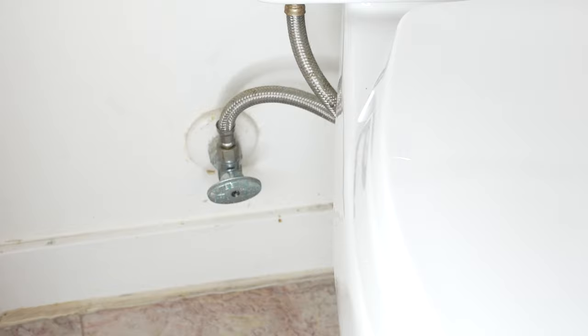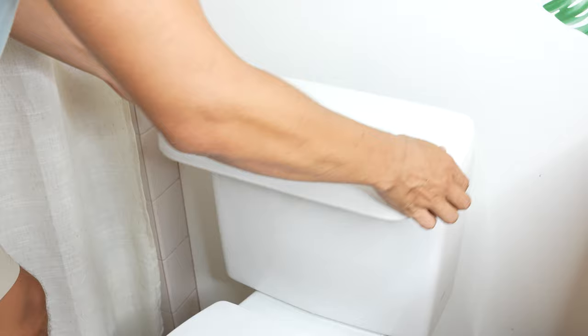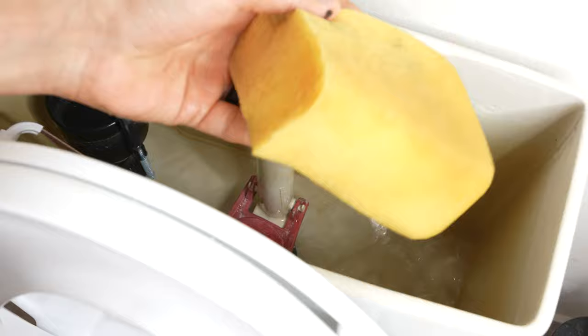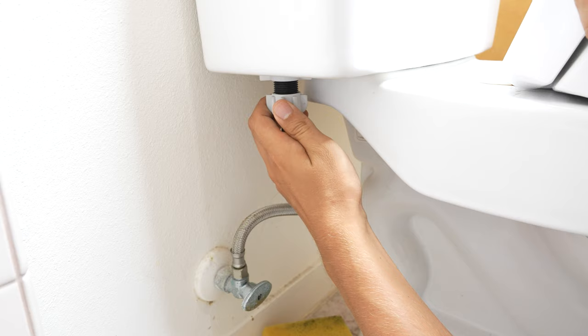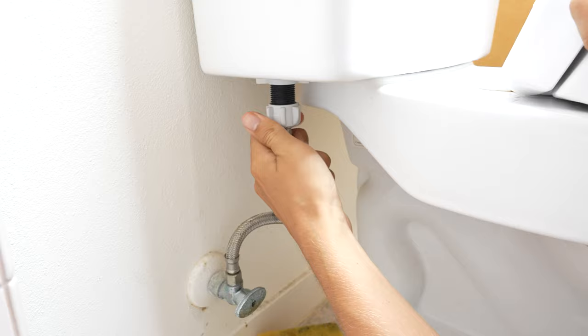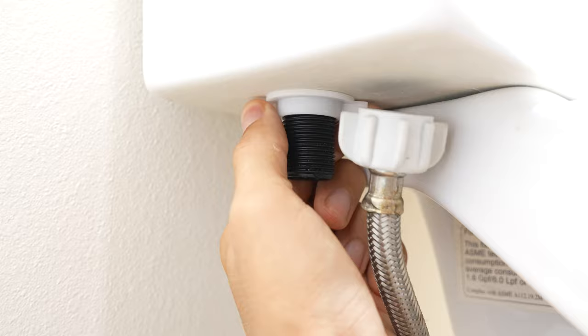Let's get this valve replaced. The first thing we're going to do is turn off the water. Make sure you know where the main shutoff is, so that if a valve starts to leak or things go south for some reason, you'll know where to shut the water off quickly to prevent any damage. Go ahead and flush the toilet to get the water out of the tank. There's going to be a little bit of water remaining — you can use a shop vac to vacuum it up or use a sponge or a towel to get the rest of it. Once you get most of the water out, disconnect the fill hose — you should be able to take it off by hand. If you can't, you can use a pair of pliers or channel locks. Then there's one more piece: the locking nut. Go ahead and slide that off too, and now we can take out that old fill valve.